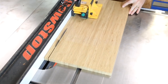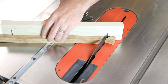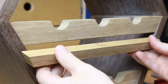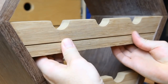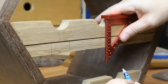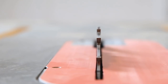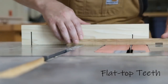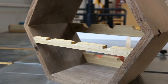Cut the back upper support much like the front support. To get the length right, cut one end at 30 degrees, fit it into the project, strike a line with a sharp pencil to mark the second 30 degree angle, cut it a little long on purpose, retest the fit, then make that final cut sneaking up on it. I also cut some thin strips to screw down to the bottom of the hexagon to cradle the round bottle on the bottom level. On the back support, the top should be the same height as the bottom of the front support. Then mark where to cut a slot to cradle the bottle for the top level. I used a 24-tooth ripping blade with a flat top tooth instead of a dado blade, and as I nibbled off the area the flat tooth leaves a crisp, ridge-free notch that cradles the bottle so it doesn't roll.